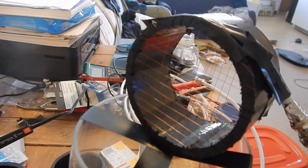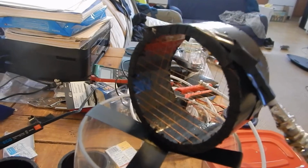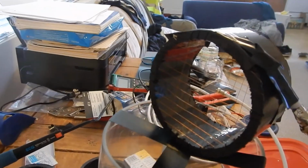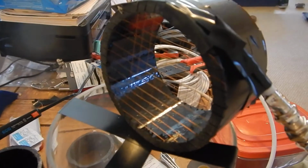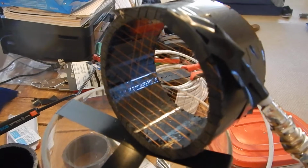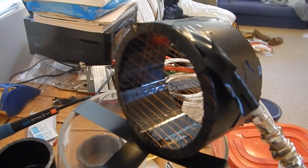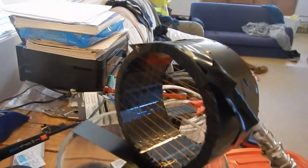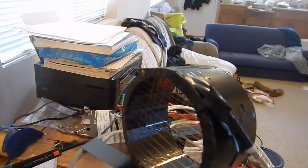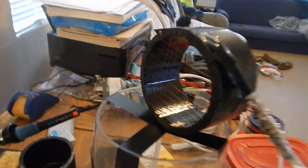Because this other side here is positively charged, and these positively charged ions are not able to pass this potential difference, this electric charge field, until they have enough energy. So basically they're stuck in here, getting hit by other particles and reionized, until they have enough velocity to pass this grid. And once they pass this grid, all the energy they expended getting past it, they basically regain as the particles are repelled out the back of the thruster.